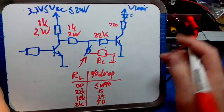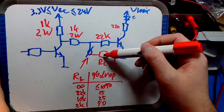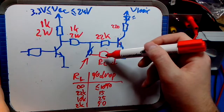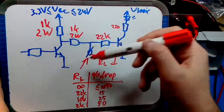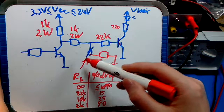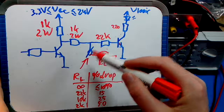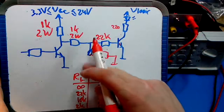and that's getting a bit ridiculous. Now note that if you have a circuit with a fairly low input impedance and you want to power it with this box anyway, you can always crank up VCC to compensate for that, right? So it makes sense to have a multimeter sitting at this point to make sure that the voltage from driving this node high is exactly what you want it to be, but most of the time it's okay, right, because there's always some margin.